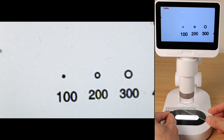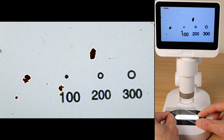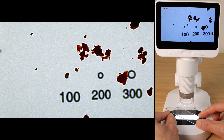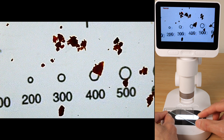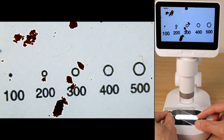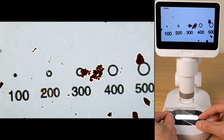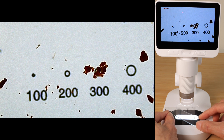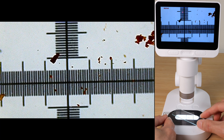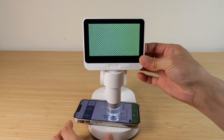These are coffee grounds. That small dot is 100 microns — we can slide the gauge over to compare size. This one is probably 100 microns, but we have much bigger pieces that are 500 microns. This one is about 300, this one is 400. We have even smaller specks too that are smaller than 100 microns. We can try to measure the really small dot right there — this line is a 30 micron line, so that's a 30 micron particle.